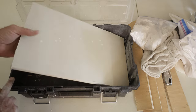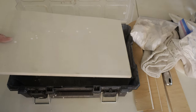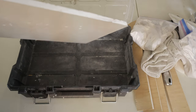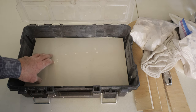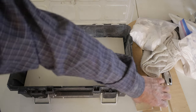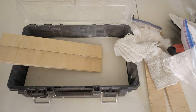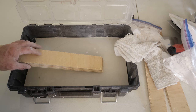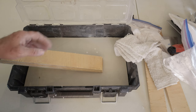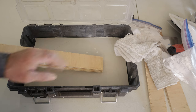At the very bottom of the box I keep a nice sheet of half-inch drywall. If I know I'm going to need a bigger piece, that's going to be a large patch. If it might need five-eighths, I'll ask the tenant if it's on an exterior or interior wall. This is just in here so that when I get to the site and empty this kit out, I can cut whatever size patch I need. I've got my backer boards, I've got everything I need in this kit from beginning to end. The only thing I'll need is a little water, but other than that this kit has everything.